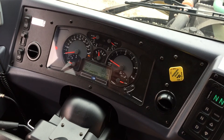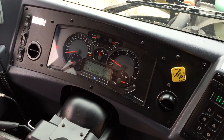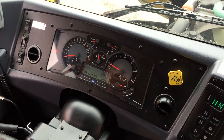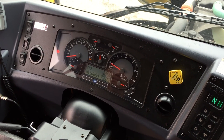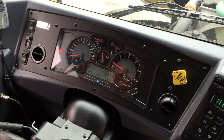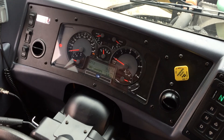That's it as far as the changes between your 2010 and your 2013 emissions. Just pay attention to the stop engine light — the other ones are indicators. Also pay attention to how you start the bus; make sure you go through the procedures properly and wait until that wait-to-start light goes out before you start the bus.